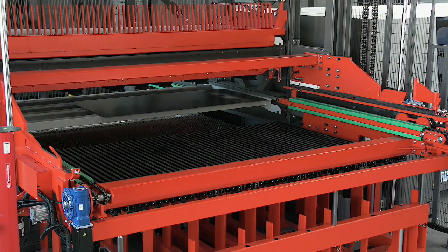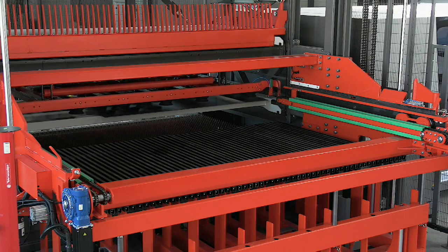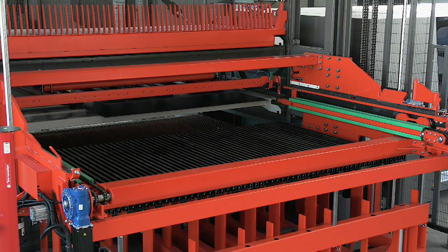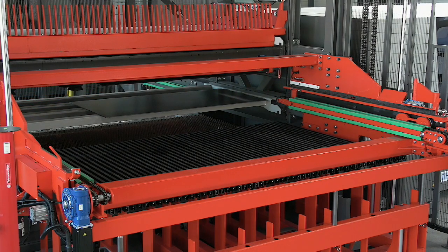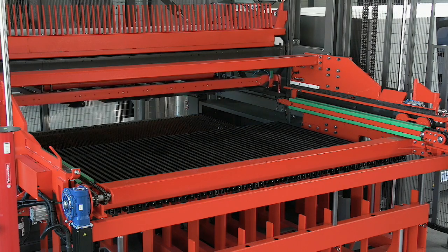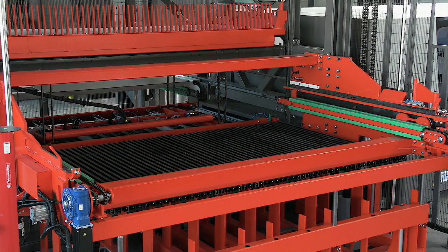This is the sheet loading process on the laser shuttle table at the start of the job list execution. The single sheet is loaded on the external shuttle table position by means of the vacuum unit. This system is equipped with the fast cycle option. The loading cassette can slide backwards so that the vacuum unit can reach the laser shuttle table.